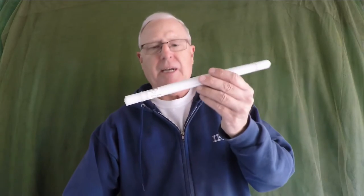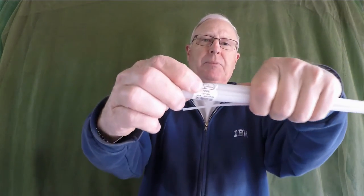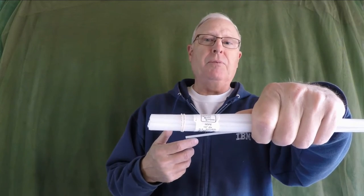The next question is, where do you get the material to weld with? My KC Welder came with a bunch of these HDPE welding sticks. You can also buy additional sticks — I got these from Amazon. These are a little bit smaller; I should have gotten the next size up. When you're buying these, you need to be sure that you're getting HDPE, because these welding rods come for PVC and other types of plastics as well.